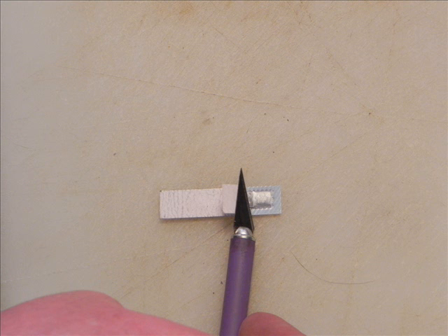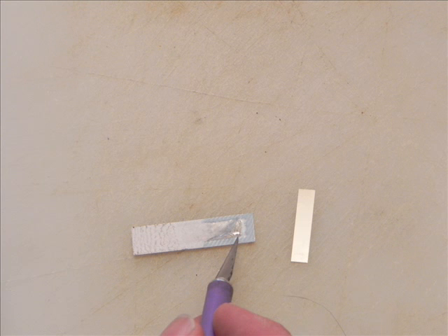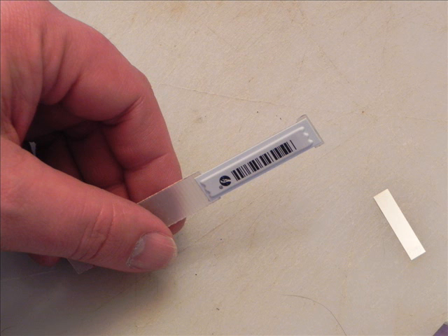Here's one of the resonant tags. If you flip it over and peel the back off, you'll find two metal ribbons in there — one of them is a bias strip, usually on top from this angle. If you pull that out, it's usually shorter than the met glass strip. That has to be left in there and it has to be free to move. You can then glue it down to a piece of G10 with notches in it to hold the coil.